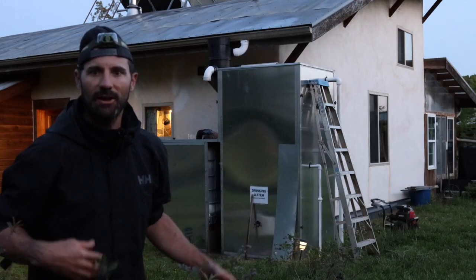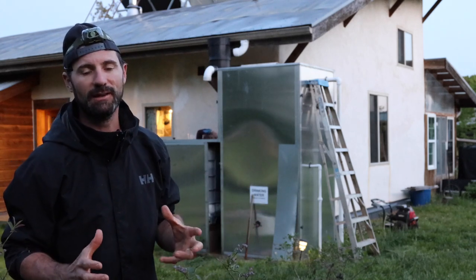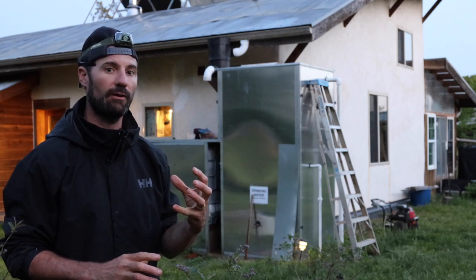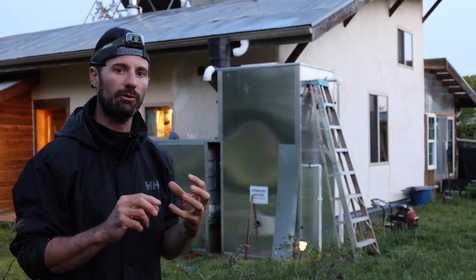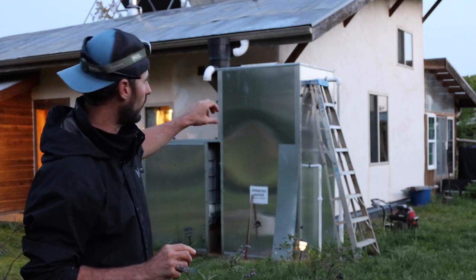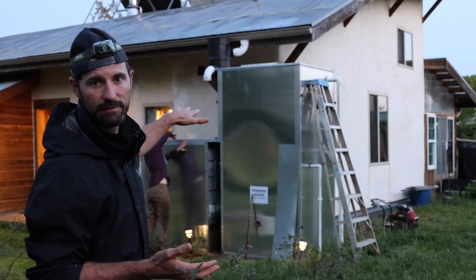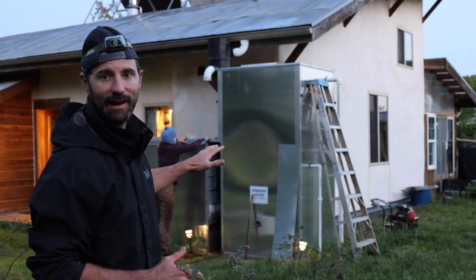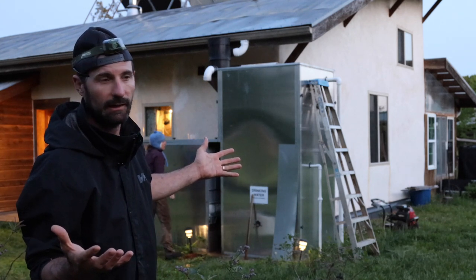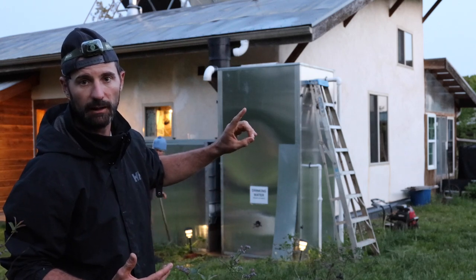It's almost dark and I want to give a quick rundown of what just happened. This is actually the first time I've had to maintain this system in the last three years — which is pretty amazing. The yellow mechanical float valve has a little cone-shaped screen that got clogged up with funk coming straight through the surge tank. Any debris that gets into the surge tank goes through the two-inch ball valve and into the mechanical float valve, clogging that strainer. If that's clogged, we don't get any water dropping from the surge tank onto our biological sand filter bed — which is highly unfortunate if we've been missing out on a lot of rain without knowing it.